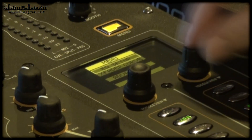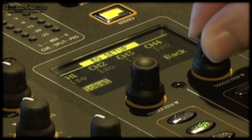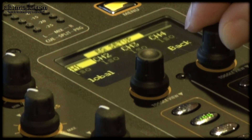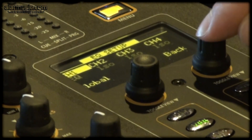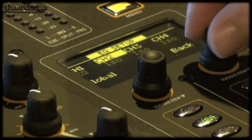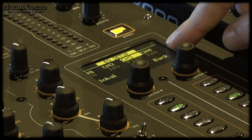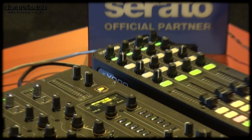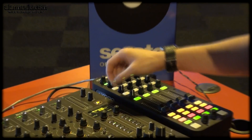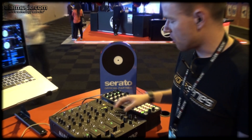So now if you go to Menu, EQ Setup, there's an option for global and then the option to move between channels and configure each one. Channel 1 is in EQ, channel 2 is in isolator, channel 3 is set to filter, and channel 4 is left as an isolator. You can now custom configure your mixer — like the DV4 with its toggle switches — to have individual EQ modes and make the most out of the trimodal EQ.